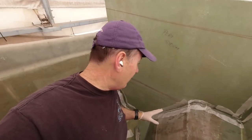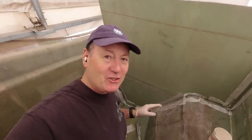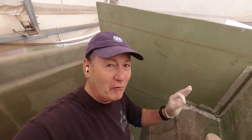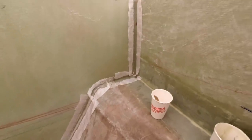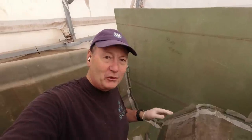Because I've got the cleat here I've had to peel ply this side. The other side's a bit of a mess so I'm going to have to get in there and try to tab that pretty quickly, because I want to make sure I integrate the tabbing into the fillet — very important to try to do that. On this side I'm going to leave it just for an hour or so to let it set up a bit, and then I'll come back in and remove the cleats once I've got the other side tabbed in. Very important you don't leave it more than a few hours because you want to get a chemical bond.